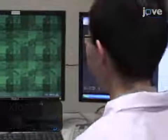Wen-Di Li's group to test the dimensional stabilities of metal mesh fabrication process by patterning 400 nanometer metal mesh with our home-built electron beam lithography system. My student Xiong is going to demonstrate the electron beam patterning process.